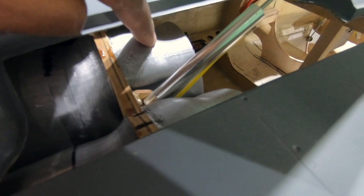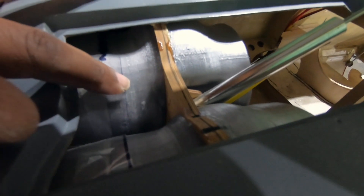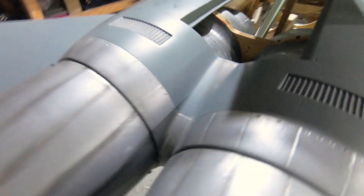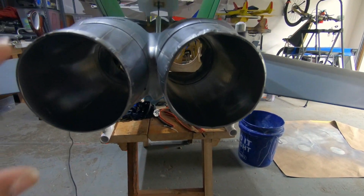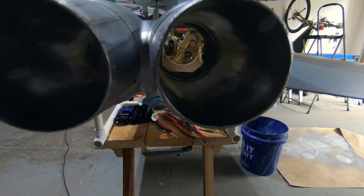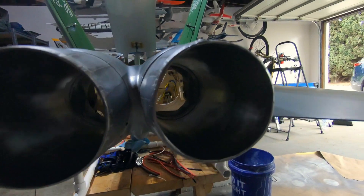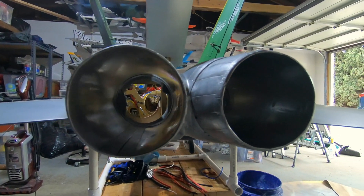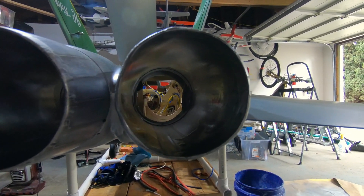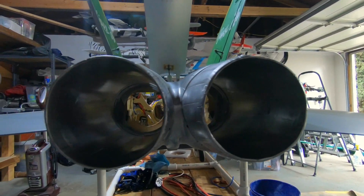So 3D printed a coupler to that, a second coupler from here to the back, and then just used a Mylar sheet to connect these pieces to the cones, which are these guys. And this is about 85% of fan swept area, so I'm hoping it'll be quite okay. The way I designed this, it tapers off nicely to the back of each 110 millimeter EDF. So we shall see — 85% fan swept area on these guys, and I'm hoping that's going to be sufficient.